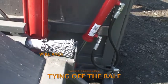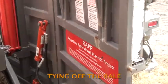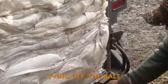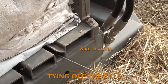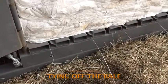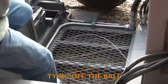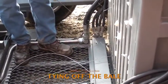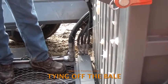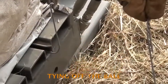The person standing by the open door of the compaction chamber removes five strands of wire from the wire rack and lays them on the ground within easy reach. This person threads the pointed end of each wire through the wire channels at the base of the baler chamber. To reduce risk of poking, WRAP staff recommend threading all five wires through the base of the baler before the second person moves into position on the trailer bed near the engine. A 90-degree bend about eight inches from the looped end will prevent that end from slipping through the wire guide channel as the wire is pulled.